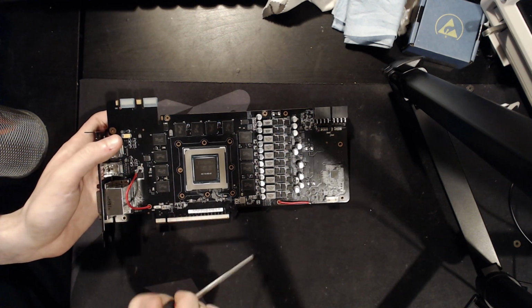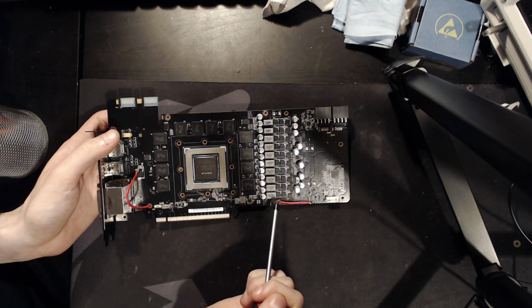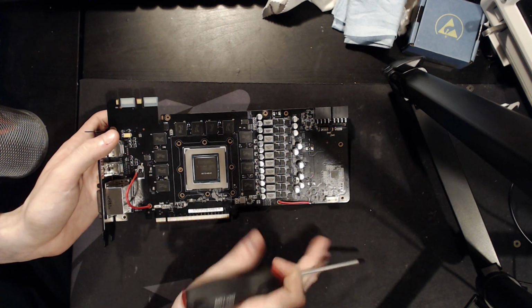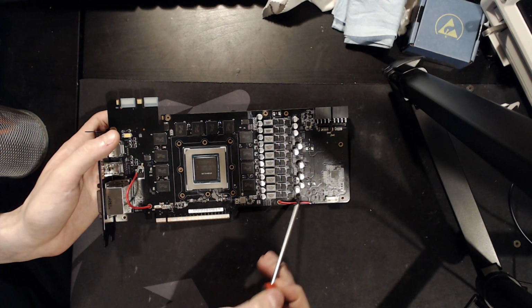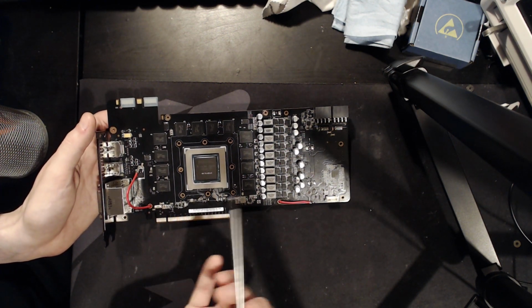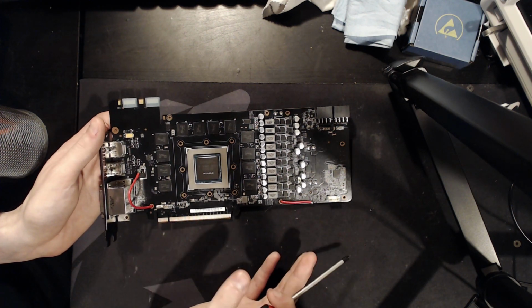And so at that point, I'm like, okay, so I'm either missing gate drive, or I'm missing straight up the voltage that these IR3598s run on. Turns out that is exactly what was happening. After checking the data sheet and soldering a little wire to a resistor hanging around these IR3598s, I found that there's actually no voltage going to the VCC pin, which is the pin where the 3598 gets its power from, and it's supposed to be at 5 volts.